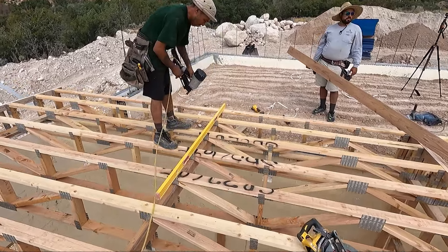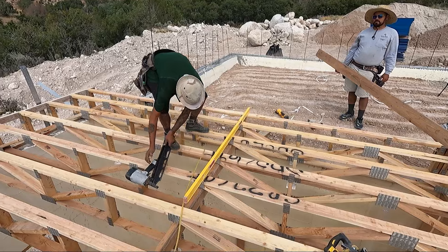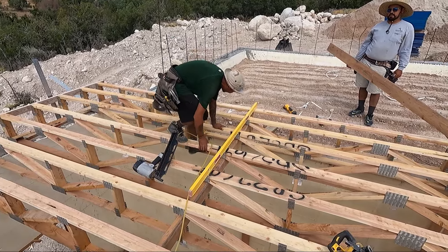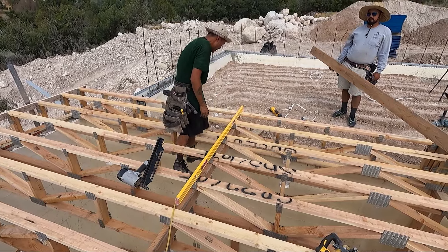There's a level laying on there because the one you're standing on is probably down a quarter of an inch. If you tack that brace on, you'll get a lumpy floor. So they keep everything in plane — watch that level.